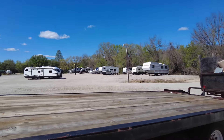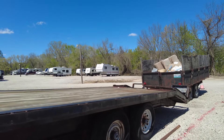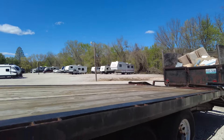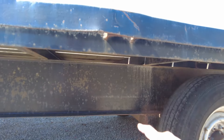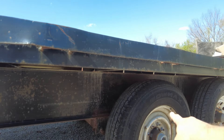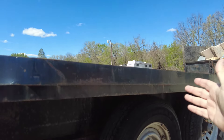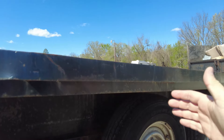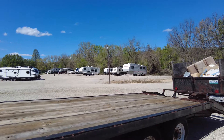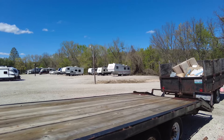The main downside is that you lose a little bit of height off the entire trailer, because the trailer has to raise entirely above the wheel well. You may have about 10 to 12 inches of less build height before hitting the 13-foot-6 limit — a limitation you wouldn't have on a traditional bumper pull, where you just have to work around the wheel wells.